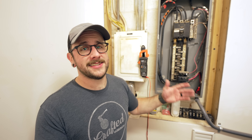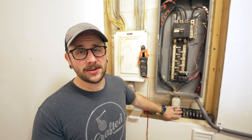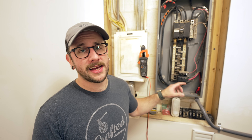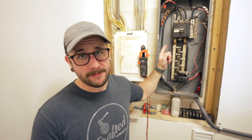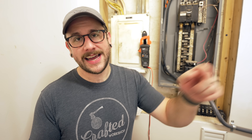That's easy enough — I can just drill and tap holes and attach a ground bus bar to take care of that. There's also no dedicated ground wire going back to the main panel because this metal conduit acts as the ground path. That used to be acceptable by code, but I need to run a dedicated ground wire. It's only about 10 feet back to the main panel, and once I do that I can connect it to that ground bar and we'll be good to go.